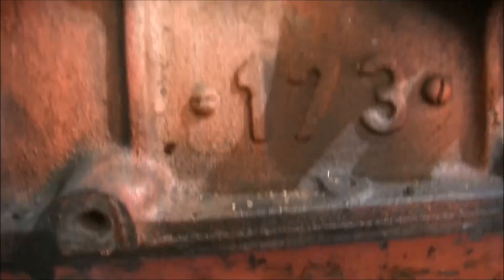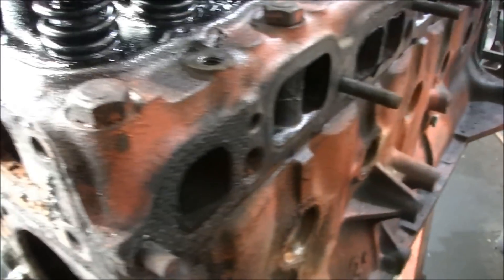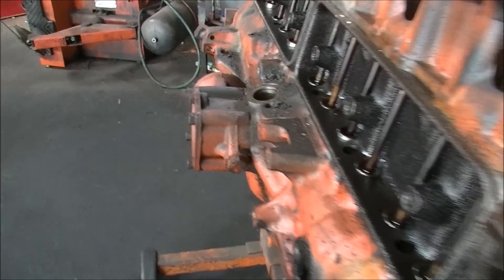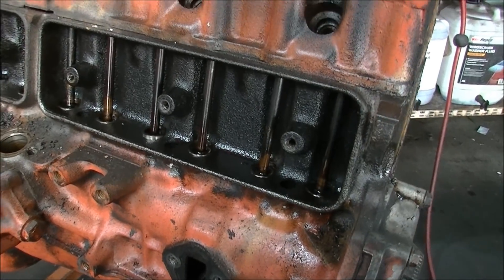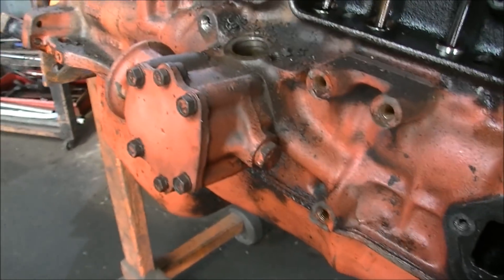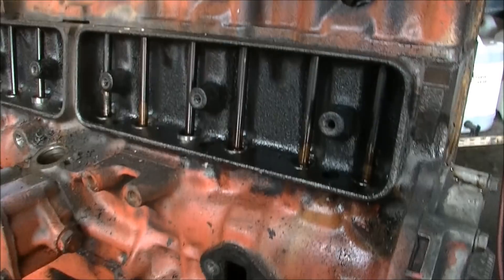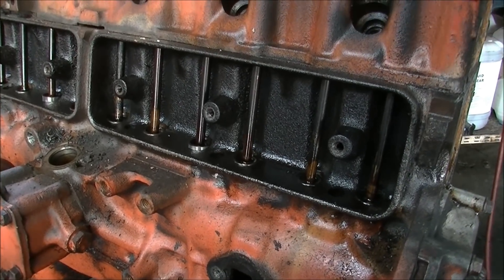From 149 — this is a 173, as I said before — but from 149 to 202 cubic inches, which kind of finished in the 80s, around '85, with the black motor. But covers, side plates, pumps, heads, all the bolts around it — it would all be interchangeable between 1964 and 1986 engines.